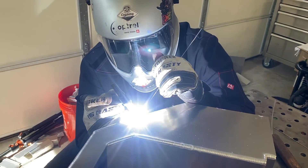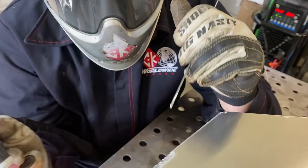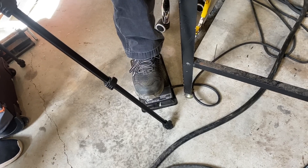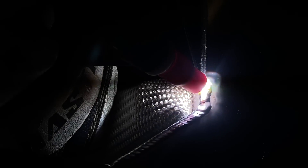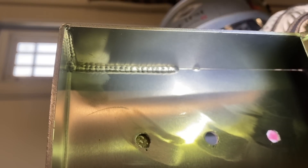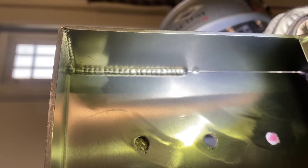Not that I think it's the be-all end-all of techniques for TIG welding aluminum - it's just a technique. But the more I study it and watch what Brad does, the more I realize the benefits. Brad uses a number five standard collet body cup and sometimes even a number four, depending on the level of humidity in the shop that day. An outside corner joint can be a weak joint if you don't penetrate much, especially if any blending is done to make a sharp corner. Watch this full penetration - even if blended to a sharp corner there'd be plenty of metal for strength. That's because he can hammer it and wrap those corners to penetrate. It'd be hard to do that without pulsing with the pedal - you'd have to be really on your game to wrap those corners with that blast of amperage without pumping the pedal.